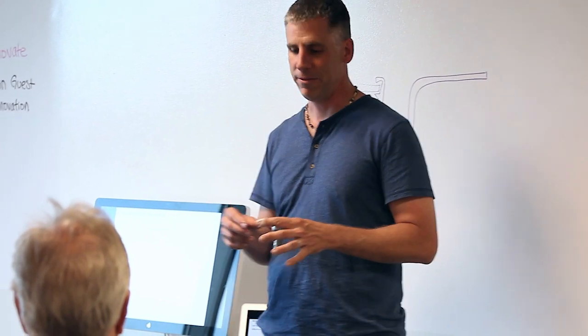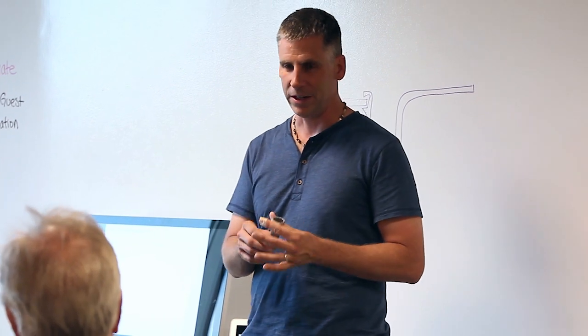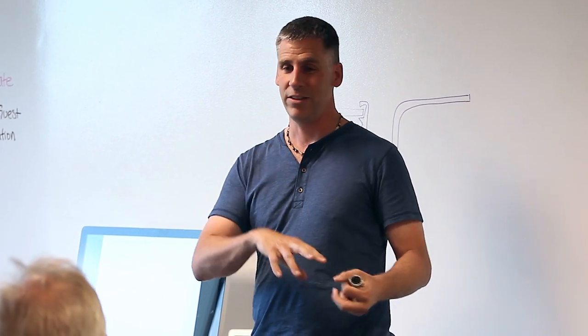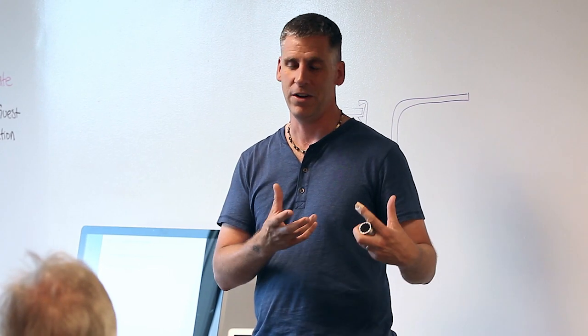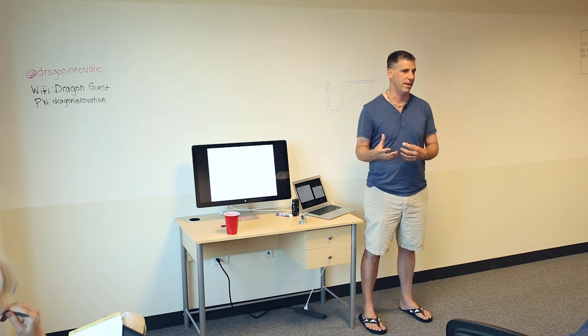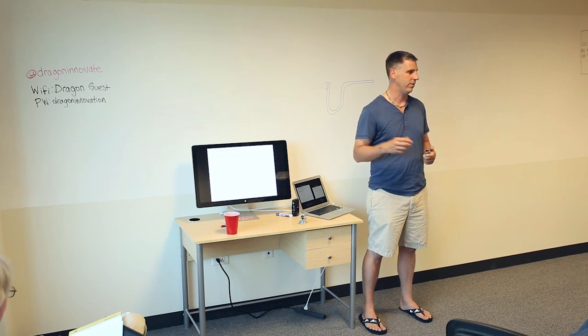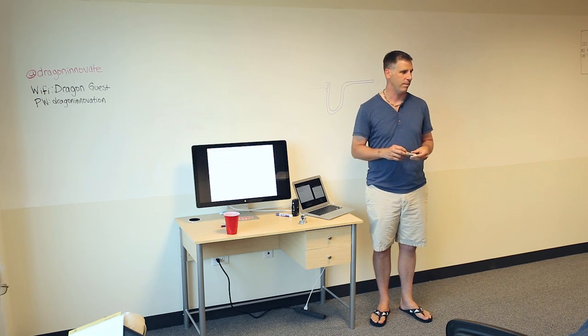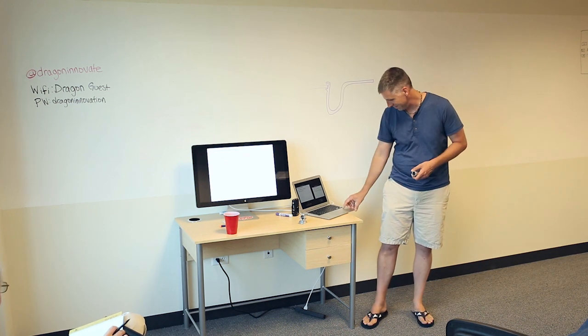And we were talking a little bit before about the techniques we use for high-volume manufacturing. When you're in the CAD stage, it's very easy to make changes. It's almost trivial. But once you've actually cut the tool, it's very expensive and time-consuming. So you want to really plan this stuff out carefully. And again, you want to measure twice, cut once.